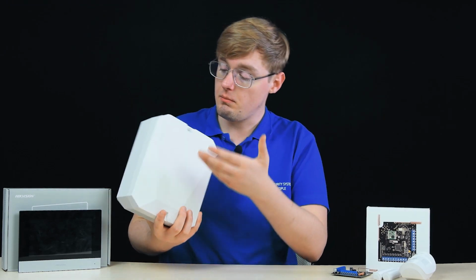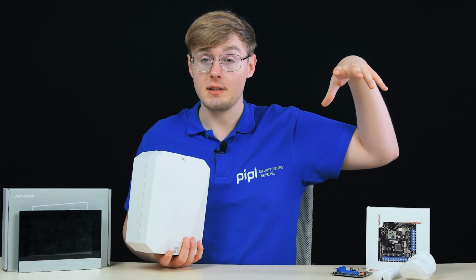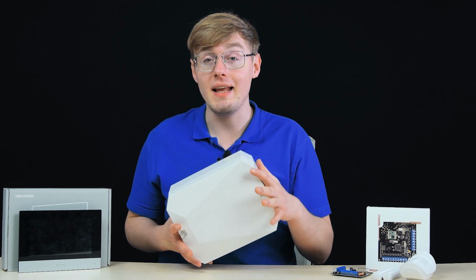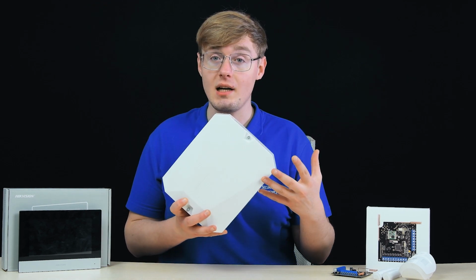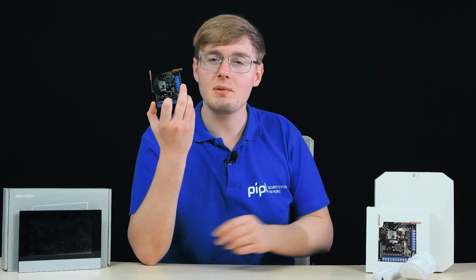Ajax transmitter, or the multi-transmitter, transmits the wired sensor signals straight into the wireless Ajax alarm system, in that way, so that they become a full-featured part of the system, if you haven't yet wanted or are not yet planning a full transition to the wireless type. And Ajax ocBridge is a completely opposite solution. It allows you to integrate the Ajax wireless detectors into a wired alarm system.